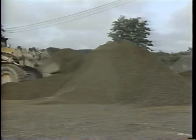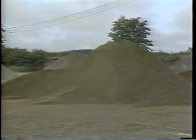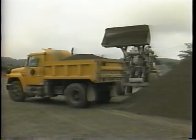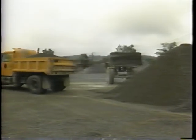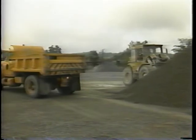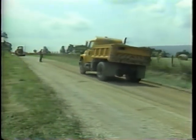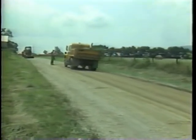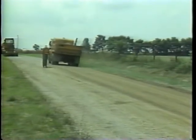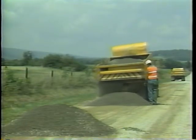Step three: load, haul, and place the granular material. Use a bulldozer to keep the granular material in a shaped pile, as front-end loaders cannot work effectively with a hard bank or a low pile of material. Organize the loading operation so dump trucks can be loaded quickly. After the trucks are loaded, haul the granular material to the work site to be distributed over the compacted subgrade. To dump the granular material, start at the far end of the work site so the piles of gravel do not obstruct following dump trucks. Space the piles according to the desired thickness for the wearing course, and dump the granular material in low piles near the edge of the road.